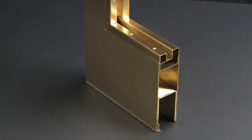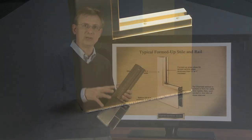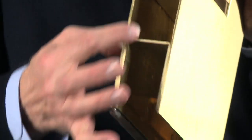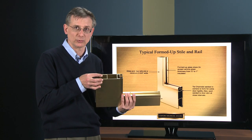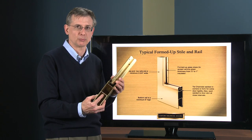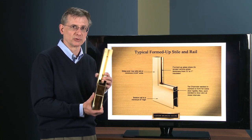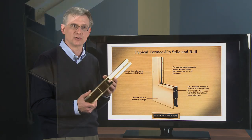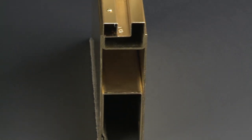This is a lot stronger than tack welding or cladding thinner materials over aluminum. The material here is a minimum of 0.09 inch — three thirty-seconds thick — the heaviest typically seen in door construction. Both the external and internal parts are all 0.09 inch thick minimum and made of the same material. A bronze door has bronze internal parts; if it were stainless, both internal and external parts would be stainless — again spot welded together for strength.